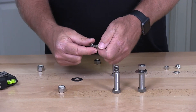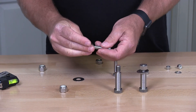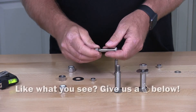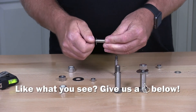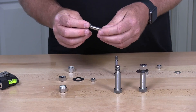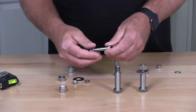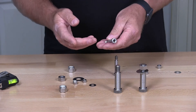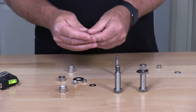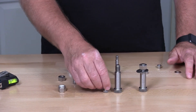You can use the shoulder bolt with a flat washer along with a lock washer, and then put a finish nut on. Or you can use a nylon lock nut, so you wouldn't have to use a lock washer or a regular finish nut — that would be in lieu of the finish nut and lock washer. You can also purchase shoulder bolts in hex head; they're available in several other head styles as well.